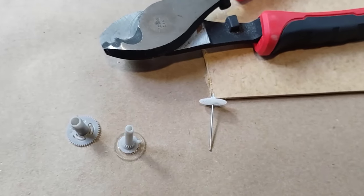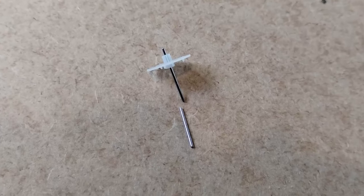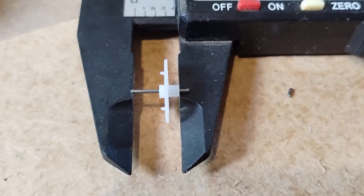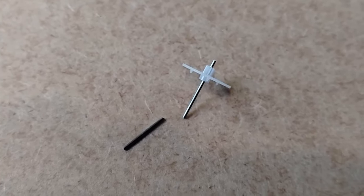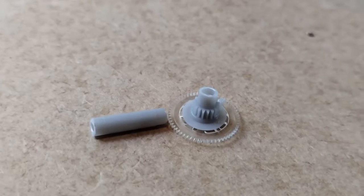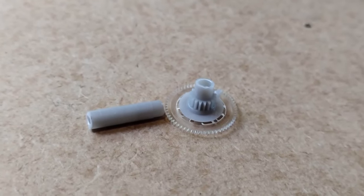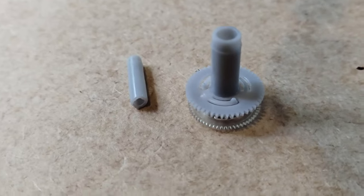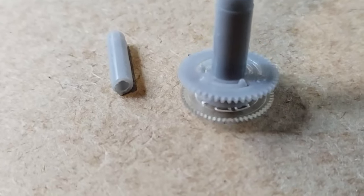Now for cutting. First, we'll start with the second-hand gear — its wire needs to be cut in half. We cut this stem so that it does not interfere with the driven movement. You'll want to cut the wire so that it is sticking up less than a centimeter from the top of the second-hand gear. Depending on your cutters, a burr may be left — smooth that out with your sandpaper. You'll want to cut the minute-hand somewhere about right here, so that it does not interfere with the driven movement and does not get in the way of gluing the hour-hand. Be sure to cut off any burrs. An easy way to check for burrs is to place it in the bottom of the hour-hand gear and see if it'll fall out under its own weight.